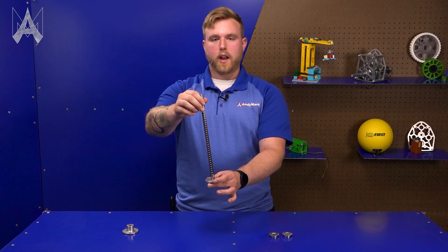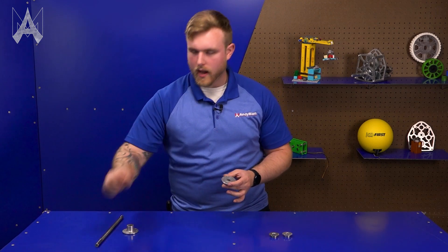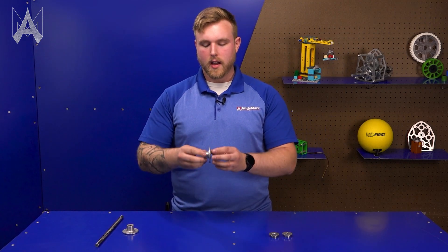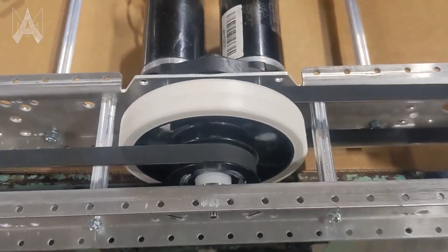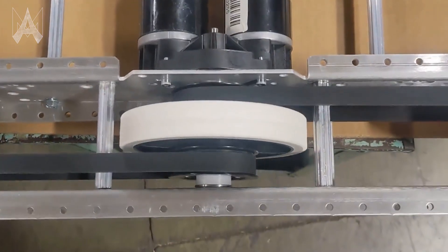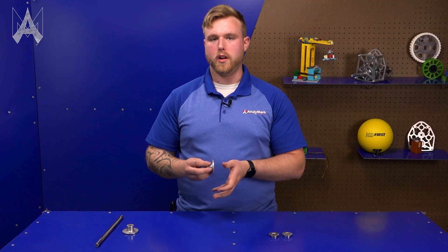This is very exaggerated, but if your broach is going at an angle, your piece when done will be a lot harder to broach because it is fighting an angle. When you go to rotate your sprocket or component, it will wobble on the shaft back and forth, and that will cause expedited wear on all the teeth or whatever you're using because it's an uneven force around whatever you're rotating.